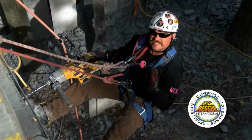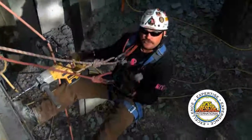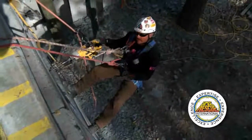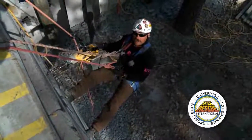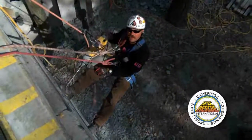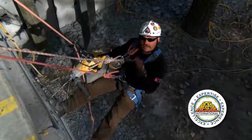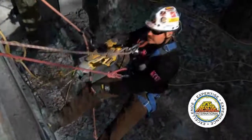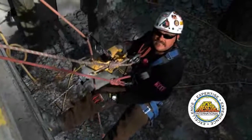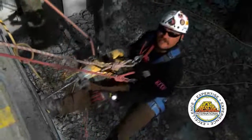The other thing I want to talk about is stance on the wall. It's a little different than normal — if you were doing a rescue, you would rappel down. You always want to have a wide stance, typical with any rescue. I want to use my legs as shock absorbers to control myself. When I start drilling, the drill is going to want to drive me back, so I'm going to use my weight and that pendulum effect to drive the bit in. I'll start up high and as I put the bit in, I'll just let my legs sink down and the bit will slide right in.